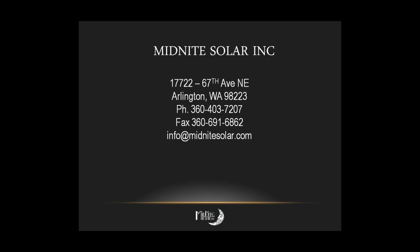Typically, what I do in most of my systems is minimize the parallel strings, and in your case, you're at 2, and that should be just fine. But I do a voltage check. Obviously, you can't do a specific gravity test on these, but you can do a voltage check at rest. So if there's ever a time when the batteries are reasonably at rest, minimal loads out, no charging in, do a battery-to-battery voltage check. Even though they're wired together, you will still get separate readings. And if you're seeing anything more than about maybe 1 or 2 tenths of a volt difference, I'd be a little bit concerned about that.